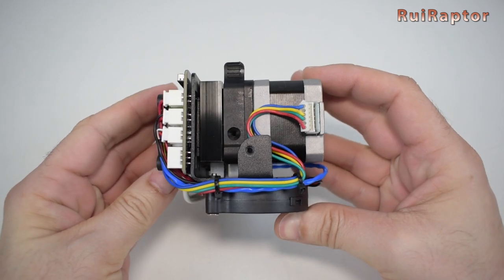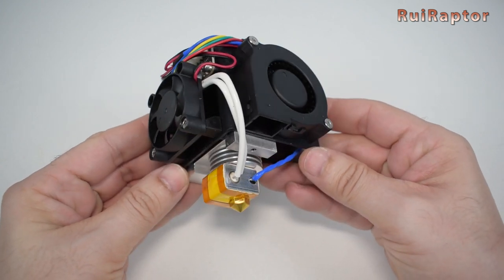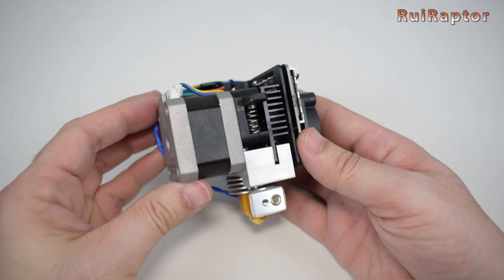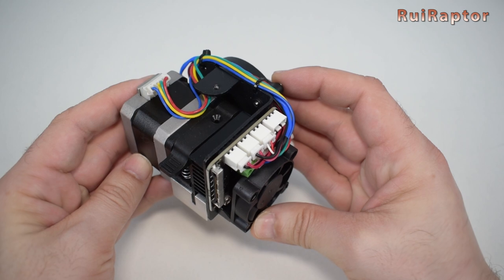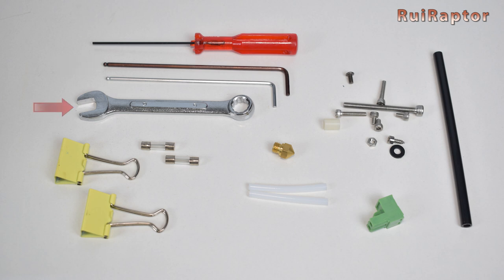The print head is set up as direct drive, equipped with a big blower fan for layer cooling and a stepper motor and extruder. The heat break is PTFE lined, which means this hotend can only go up to 240 degrees C. At the front is the breakout board and the fan to cool down the hotend. Inside the bag with tools, we have a few allen keys, a wrench, a couple of spare fuses, metal clamps, spare PTFE tubes for the hotend, a spare 0.4mm nozzle, spare screws, spacer, washer, nut, a spare connector for the board, and a spare filament guide.